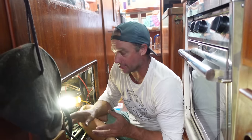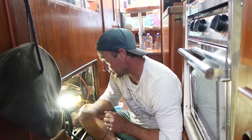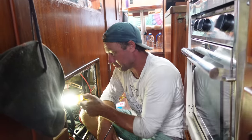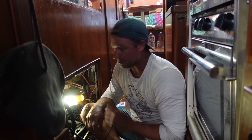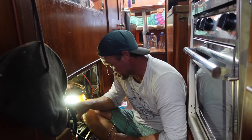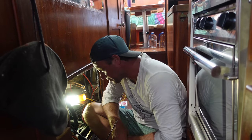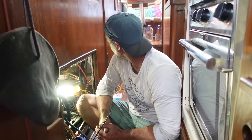I've removed the heat exchanger. I've got a little bit of prep work where salt water's been coming out of the lines — I'm going to clean that all up, maybe give a little spray paint. We'll get our heat exchanger on, new pipes, new clips. That's the sort of maintenance you want to focus on — these things that can actually cause you real problems down the track. Bella is his lovely assistant today. I don't know where she is... Bella!